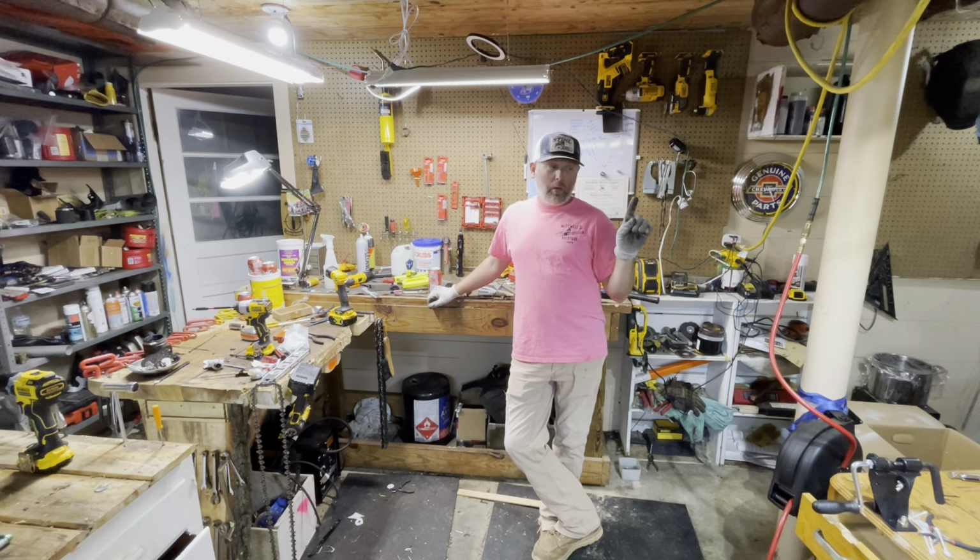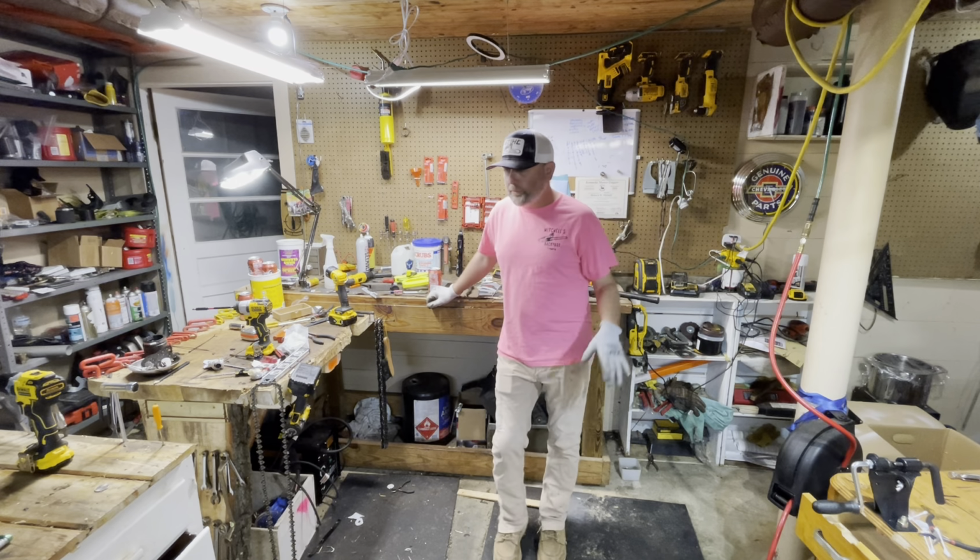I've gone through a 100 foot reel of the Holzforma chain, and I've still got some loops left over with a few teeth here and there. Now I'll play around with them and whatnot. I was playing with them on my grinder, and they're still about halfway. And I'll eventually circulate them back into the rotation. Some of them I tried to do that hexa grind on them, and my angles were kind of aggressive for the hexa. I found out if you do like 22 degrees on your stone, you kind of get that. But anyway, I'm not trying to get off on that topic.